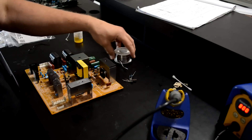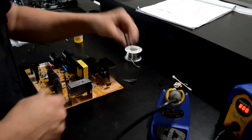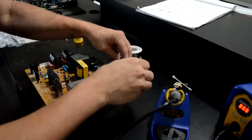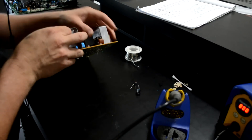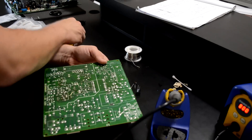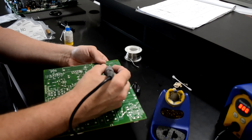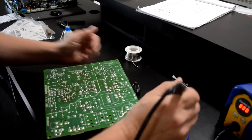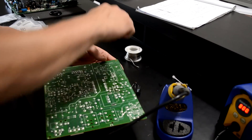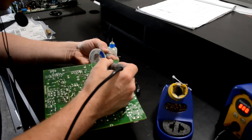Now I'm going to start recapping — adding my new capacitors back into the old spots. Start by placing and matching up the positive and negative; you want to make sure you've got that in the right spot. Add some flux on there, and then I'm going to tack it into place — just one of the legs — where it can be held. Then I'll come in and snip off the legs down to the shorter size, and solder them into place permanently.